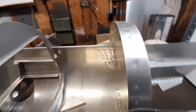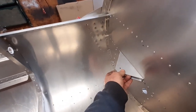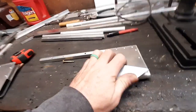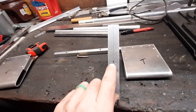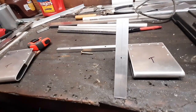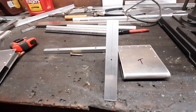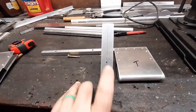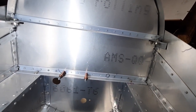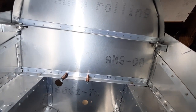Now what we need to do is mark the center line of this, put it up on there, and drill and cleco it into place. I've got the center line marked, then I'll spot in the center and center punch that. I'll drill that one hole, hold it up against the firewall — everything end-to-end should be fine. Get the center one in, cleco it in place, line up the center line with the hole, and drill the rest. I've got two drilled and clecoed. I can see the line down in the hole, so I'll go ahead and finish drilling the other five.